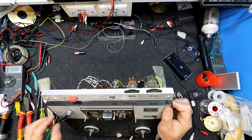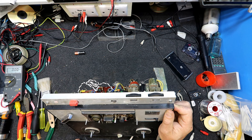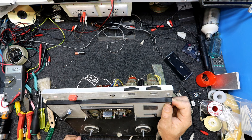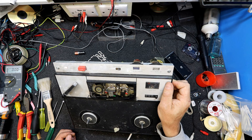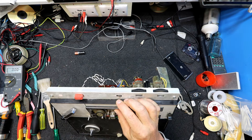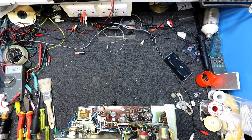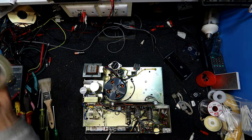Pinch roller is not engaging. Well, at least it won't chew a tape — we can't even get the pinch roller in place. If I push it right down... that reel's solid, that's why. Oh there we go — just turning it got it running again. So this probably could be made to play just as it is. I don't have any audio hooked up though — there's no speaker. I need to watch where the speaker wires are. It should be transformer-coupled, but I've got to be careful what they're touching. I should tape that in place.